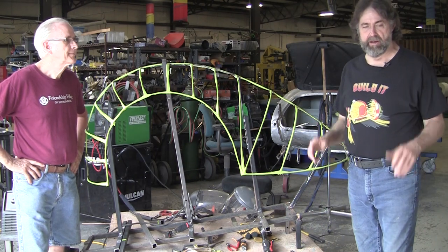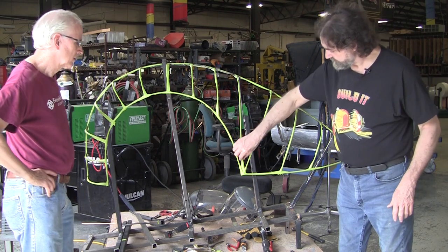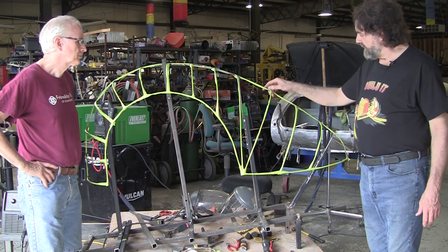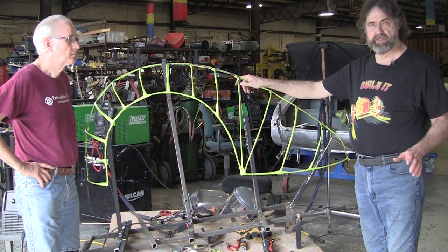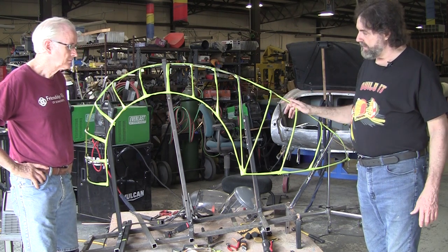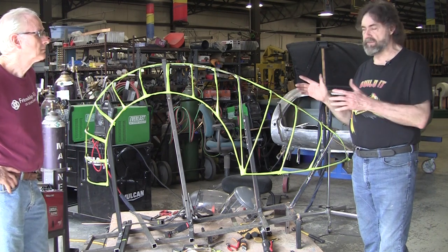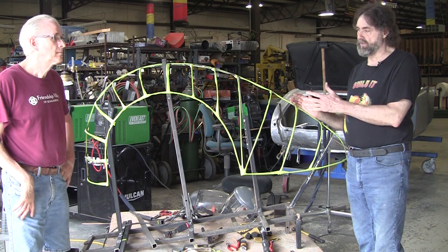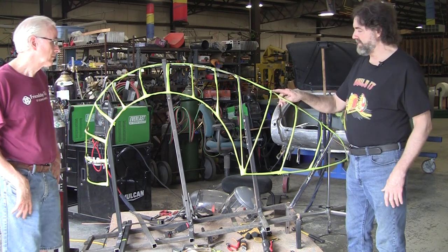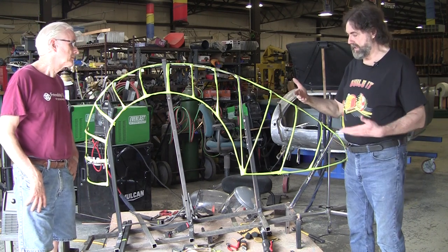We might even offer them for sale now that we've got stock. This is all made with quarter-inch hot roll. Peter had zero experience doing this — he bent all these himself. I showed him the process, and what we did was widen this out about an inch and three-quarters or so because we're going to have a little bit bigger tires.